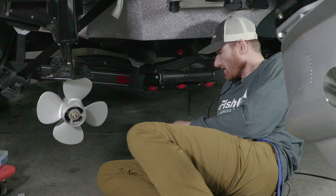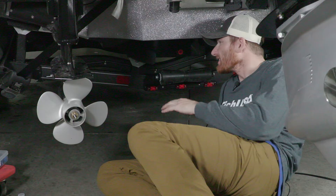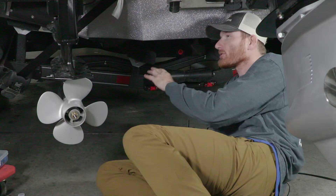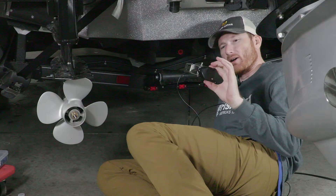Each and every boat is going to be different as far as where the proper location is. To run a skimmer like this, you're going to get the best sensitivity — the best eyes under the water. You want to avoid mounting near rivet lines if you have an aluminum boat, or chines, or anything that's going to move or make air bubbles — right-hand rotation from your prop, drains, things like that. We're going to mount this skimmer and show you where it works best on a Ranger 600 series boat.